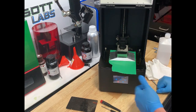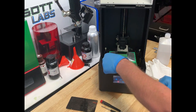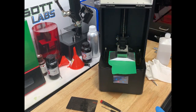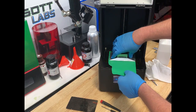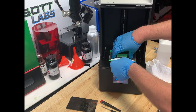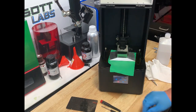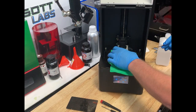There is a stop button on the front, but having my hand here is faster. Alright, we're down on the plate. What we want is we want it to have the same resistance — when you pull this piece of paper, you should get a little bit of resistance. You should be able to push it with some difficulty and pull it with some difficulty. You want it to feel that way across the entire plate. Then you're going to take your hex key and hold down gently.